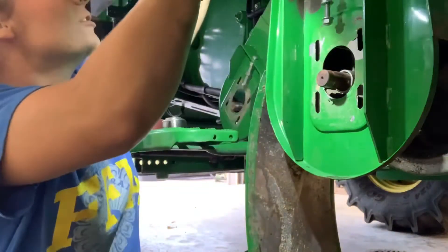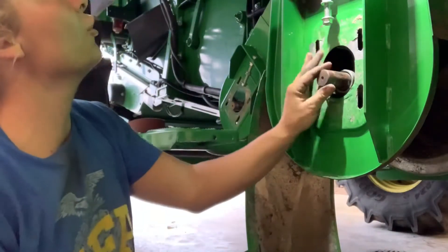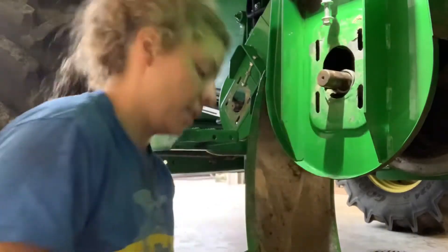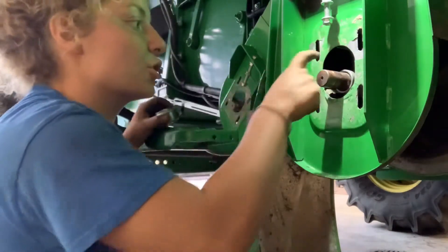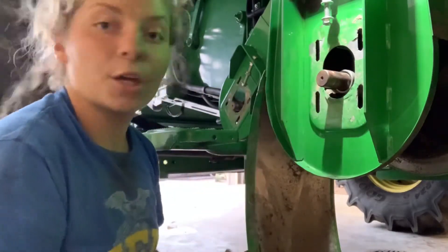So let me move the light down. Right now, I'm putting a new bearing on the clean grain elevator. First, what we need to do is shine up our shaft so that the bearing can slide right on. So I have some emery cloth, and I'm going to shine this up quick. Then I'll put my bearing on and all the other pieces, and that will be good.